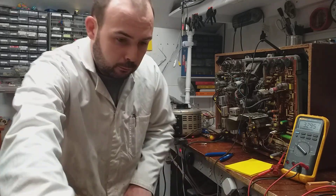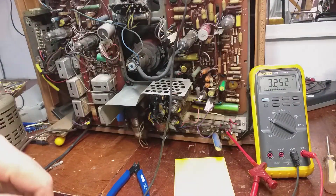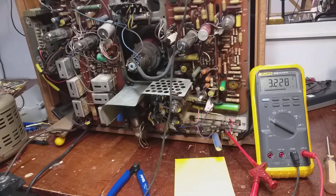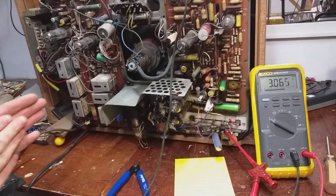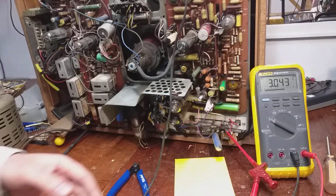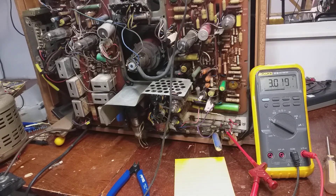I thought hmm, so I'll bring you them for a look. I snipped the snubber cap - went again, the fuse was blue. Checked the diodes - fuse was blue. Checked the electrolytics, couldn't find any that were short. So I thought, well, if I powered it up on the Variac at about 50 volts I might see where the voltage is disappearing, or see a resistor overheating or whatever. And I kept winding it up and the thing came on, so I don't know what the crack is.